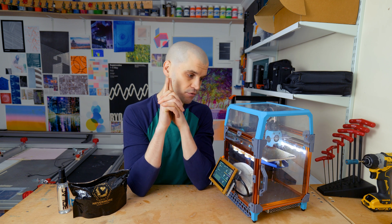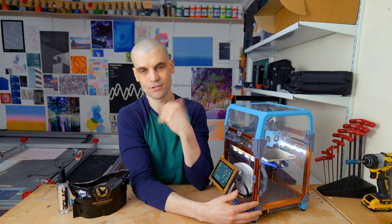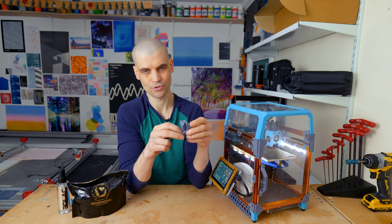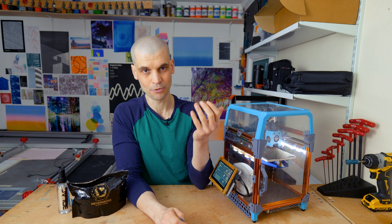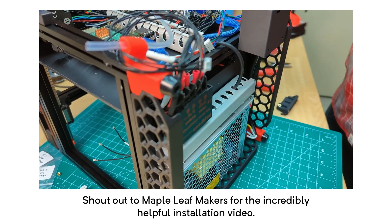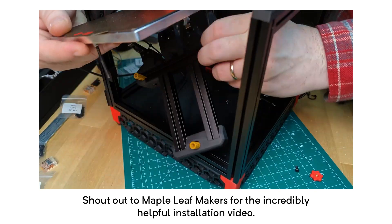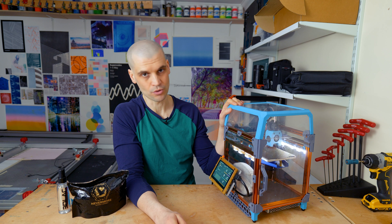The last modification I made to the Voron was the Kirigami bed — an all-metal bed. Many Voron Zero users will have experienced leveling the bed and then finding it's not printing as well a few prints later. I think the plastic ABS parts for the stock bed sag a little over time due to creep, which meant I constantly had to tweak the first layer. The installation was a bit painful given how this printer is designed with maintenance as an afterthought.